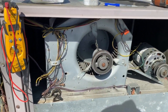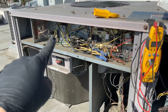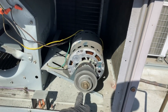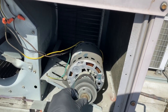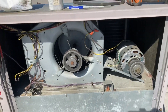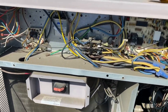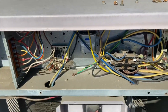We're going to check that capacitor over there and then I'm going to see about adjusting the pulley — I kind of want to but kind of don't, because these can be a pain. It's a trial-and-error thing and usually they never move the first time. The airflow is actually pretty good downstairs so I might just leave it. It's running at two amps so it's efficient.